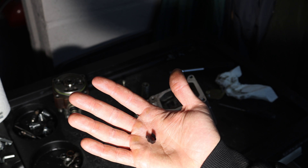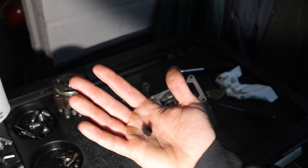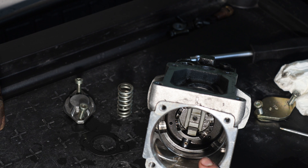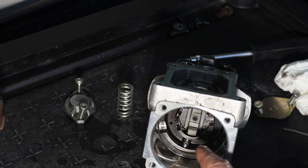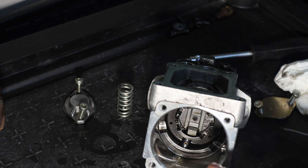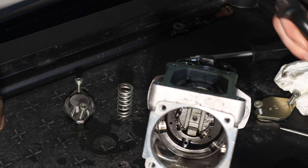I just cut it off and it flew right between my two eyes, so yeah, that's kind of dangerous. Now you have to remove a second pin inside of the pin — the clip we just removed is to retain the pin inside of the pin. It sounds weird but it makes sense once you're in there. Take needle nose pliers and just pull it out — it is really tiny, don't lose it.